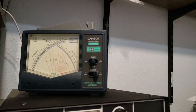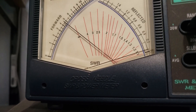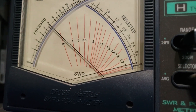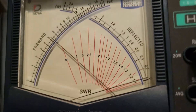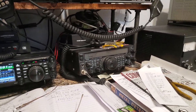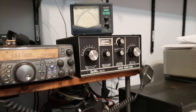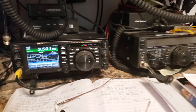I'm going to turn the transmitter on. Then I'm going to move the tuning knob first, and I want to achieve maximum output — just by turning it back and forth a little bit. Then you go to the loading knob and do the same thing. In my case, the loading knob is all the way down where it's maximum. So now we've tuned the antenna to about 1.2 to 1, and tuned the amplifier so it's properly adjusted for 3591, 80 meters.